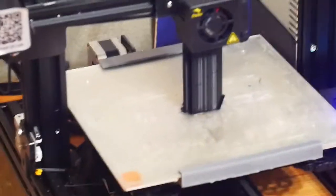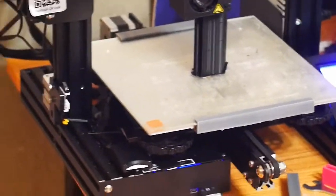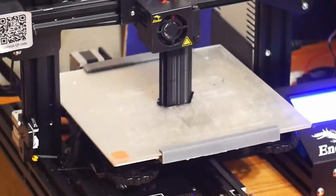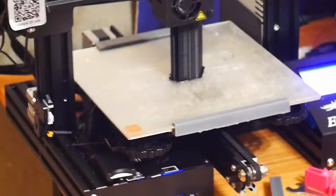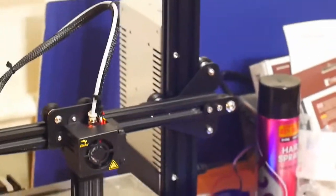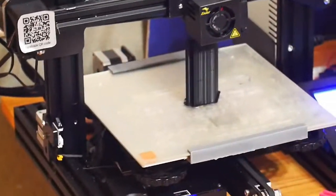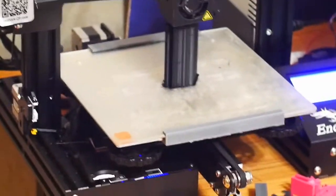Let's talk about the Ender 3 for a second. Those are my custom glass plate holders. They work real well. The screws don't work well, but you don't really need them. Once you get the bed more stable and you get that adjustment, and once you get your Z-axis on the right side adjusted so that it's almost loose, but it slides freely up and down, the bed has only the most minor of wobble when you take prints off.